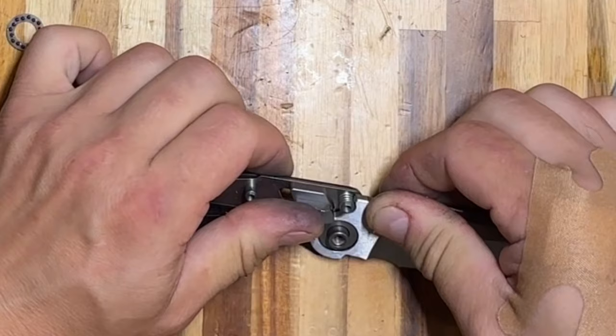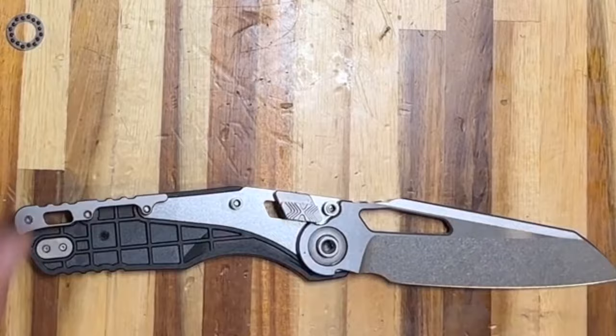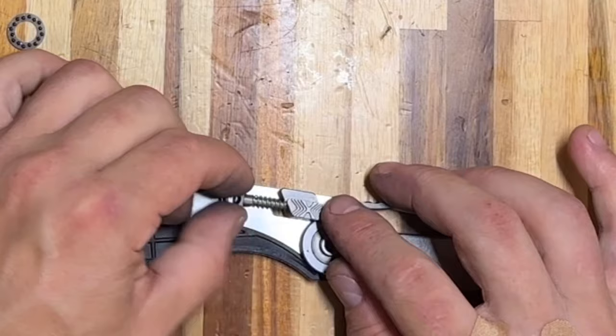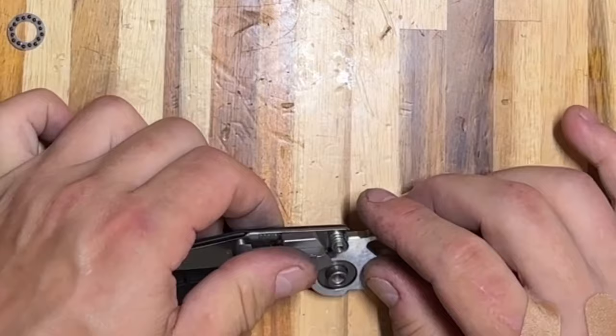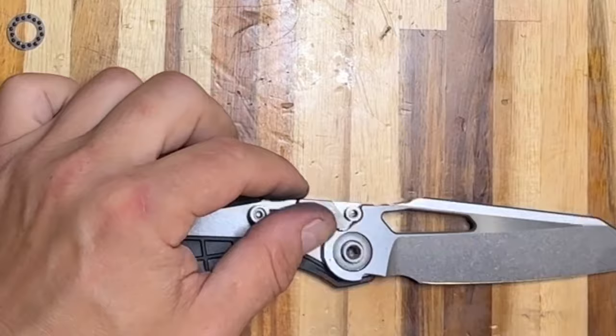The air gap between the front of the RAM head and the front of the slot on the liner is gone. I think that was the original intent of the designer of this knife, but the manufacturing process at Microtech does not involve hand fitment. For $176, I did not expect hand-fitted quality from Microtech — however, lock-to-blade engagement is not a place to take shortcuts in production.